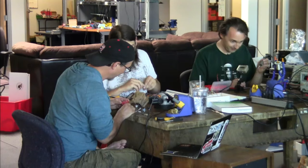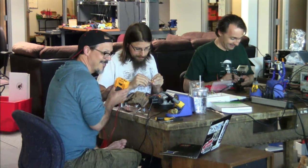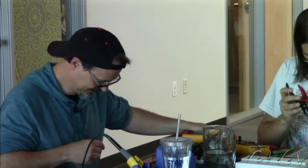I'm trying to anticipate how many things I may have made mistakes on. Kids, for anybody watching at home, always test your V plus and ground to make sure it's not shorted before you plug it in for the first time. You can bet that I'll be doing that today.